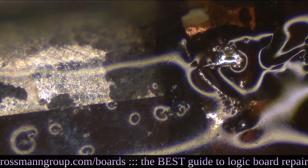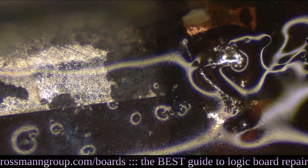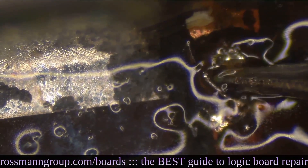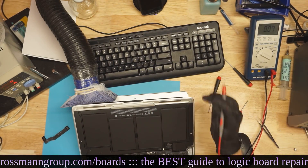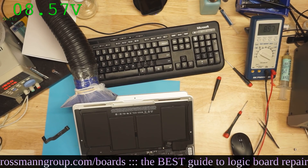Just to give you an idea of the size of that wire, let me show you what the tip of my tweezer looks like. These are some Dumont 5.5E tweezers. So that's what my tweezer end looks like, and that's the size of the wire. Backlight voltage is zero. Fuse voltage is eight. Voltage into coil: 0.1.